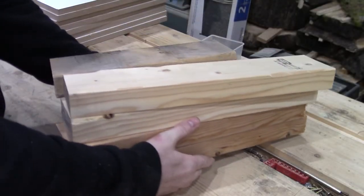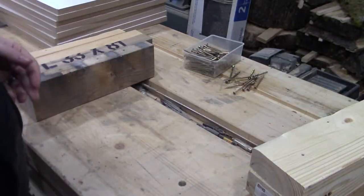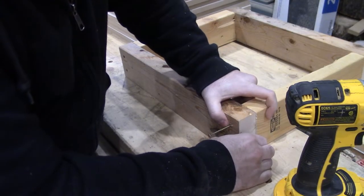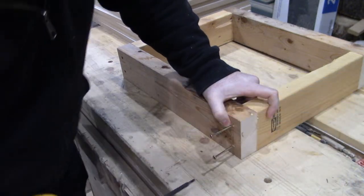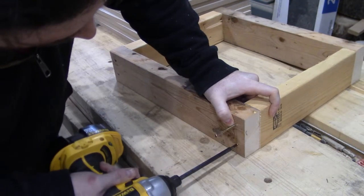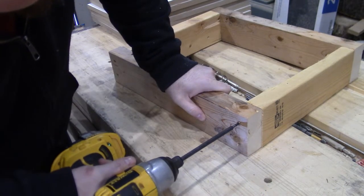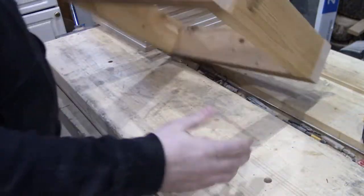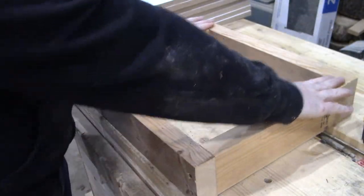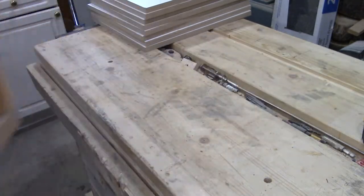Now that the cabinets and the cabinet materials are out of my way, I can start working on the base of the cabinets. I just went with a quick box out of 2x4s that were a half inch smaller in both directions than the footprint of the cabinet. It's going to be covered by either the wall, cabinet, or baseboards anyway, so it doesn't need to be pretty, and it raises the top of the bottom panel to the same height as the top of the baseboards that I'm going to be using, so it just works out.